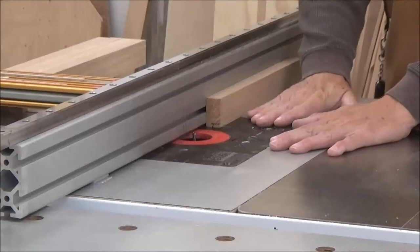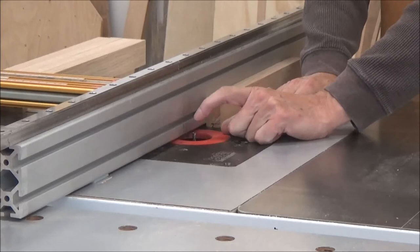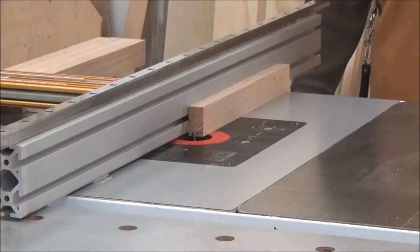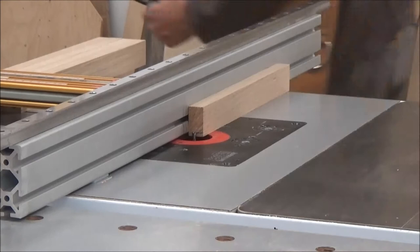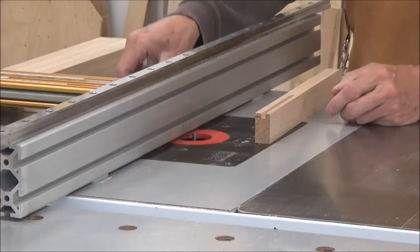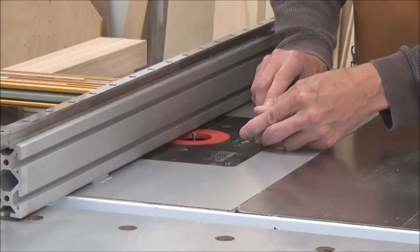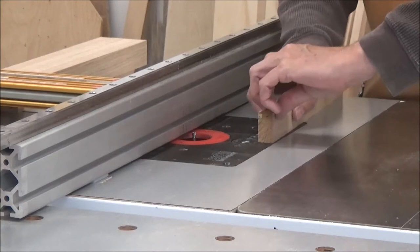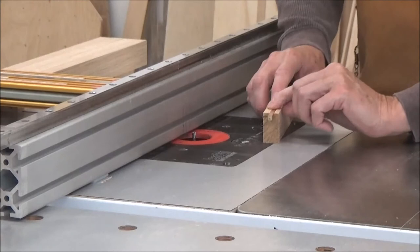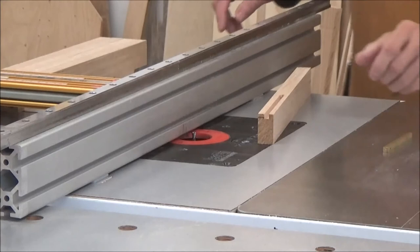That's nice and square. I've got my router table set up for a quarter-inch depth cut, a quarter-inch groove, a quarter-inch away from the fence. I'm going to run this test piece and check it before I run my actual pieces. Maybe just a fraction deeper — the quarter-inch away from the fence is good, but my depth has got to be just a bit deeper, so I'll make that adjustment.